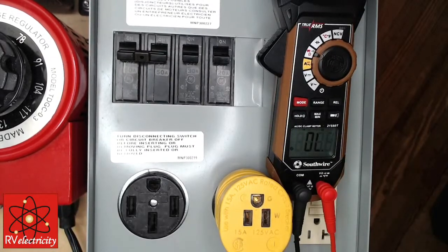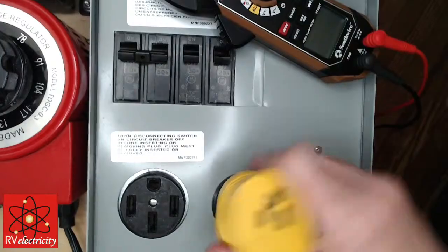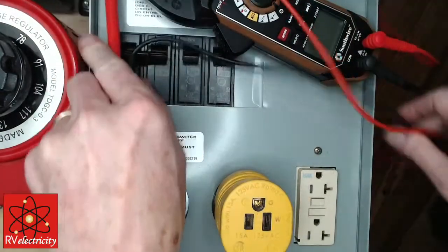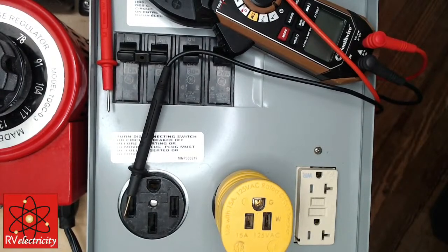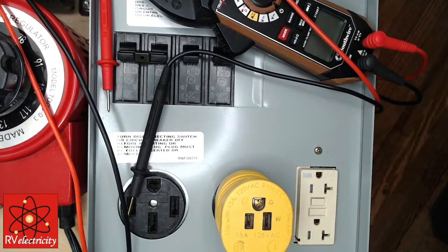So that's what you're trying to do. You're trying to establish that you have continuity in here, and it really is just breaking this down into smaller and smaller chunks. We're not looking to check the impedance of that grounding conductor. All we want to know is that there is a continuous path, and that it's there and it's working. So that's a good test for continuity. Yeah, it really is, and 99% of the time, all you want to know is a go/no-go situation. Exactly. Now, when you're measuring voltage, especially looking at battery state of charge, that's a whole other program all in its own thing.